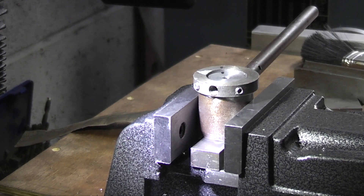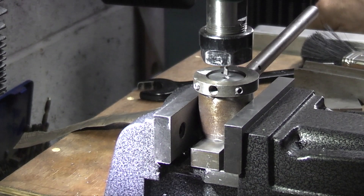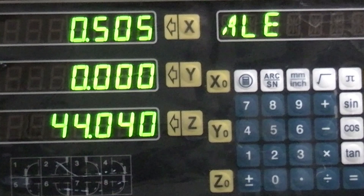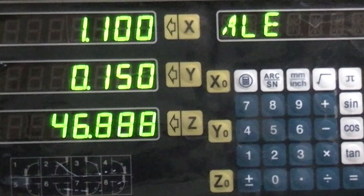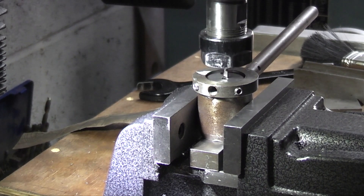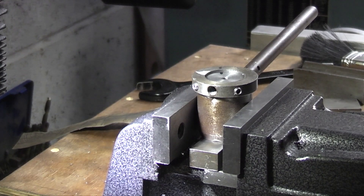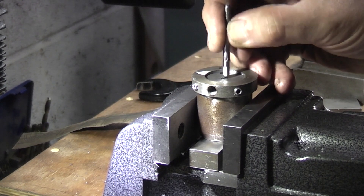Turn the tool around again 90 degrees, so I'm going towards the tool about a millimetre, and then start cutting side to side about 0.3 in each direction. It depends how you've grabbed your tool - the distance you'll have to work out from the tool. You can feel it just taking a little bit out. Now there's a tap I want to go in there - you can see that's not that far off now; it's gone from a round hole to a square hole.